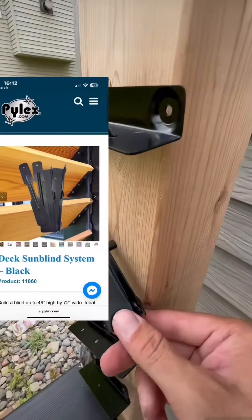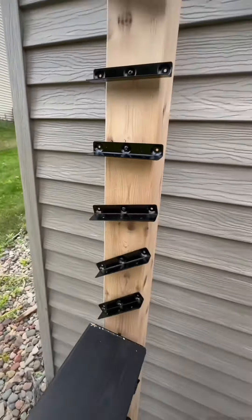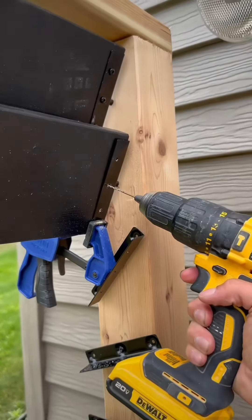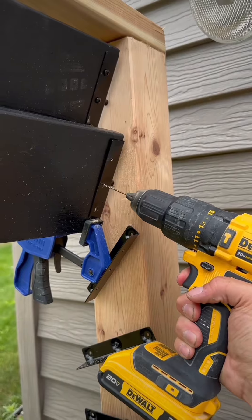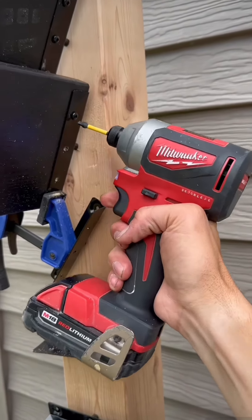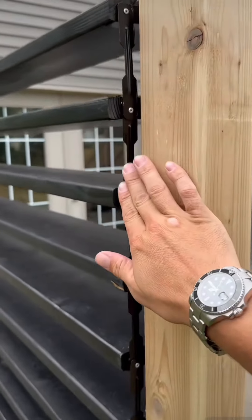This is a screenshot of the hardware I used, and I actually just ordered it through lowes.com. You're going to put one screw in this L bracket so it can spin on the center. The other three holes on the other side are obviously going to hold your material down. Always pre-drill — pre-drilling is going to prevent your wood from splitting, and if your wood is splitting, it's not going to hold. In this kit, there are also screws provided. Just do not over-tighten them.